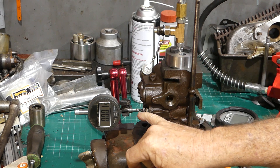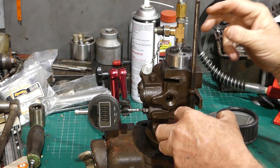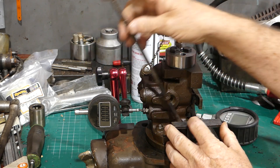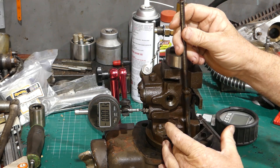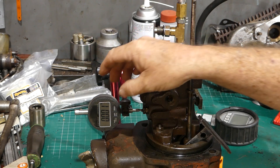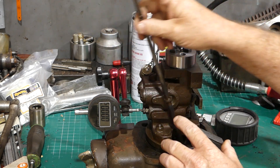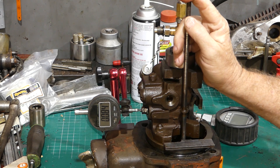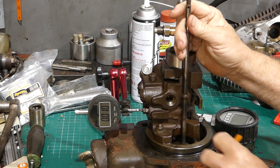There's a screwdriver slot at the end so I do have a slight variance sometimes. Using the bottom hole of the tool now — it's a snug fit with no movement. I zero the dial gauge, start at half a thou, bring it down and hold it down. The original tool gives us 84 thousandths of an inch travel on the spool.